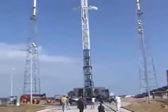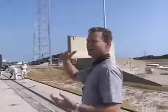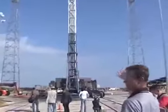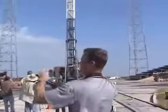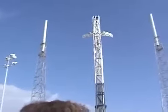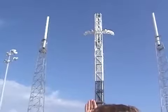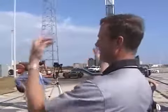On launch day, when the booster rolls out and goes into the vertical position, it's basically a 12-minute operation to go from horizontal to vertical. Once vertical, we plug in quick-disconnect lines for the RP-1 and the liquid oxygen — down at the base to fuel the first stage, and then up at the top near those clamp arms is where we plug into the second stage. The first stage goes up to right about where those two big white ducts start, and then the second stage and payload are above that.